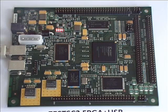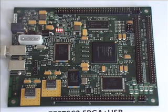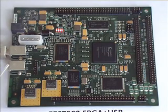With up to 95% efficiency, the onboard 10 watt power supply unit enables the board to be either bus powered from a high power USB port or self powered here from a wall adapter. If the board is fitted inside a PC, it can be connected to the hard disk drive power connector here. And a secondary USB port is also provided that enables up to 5 watts to be supplied from a host PC.